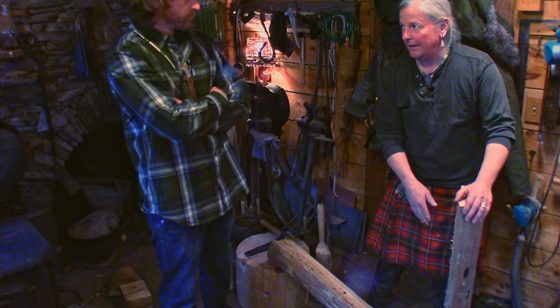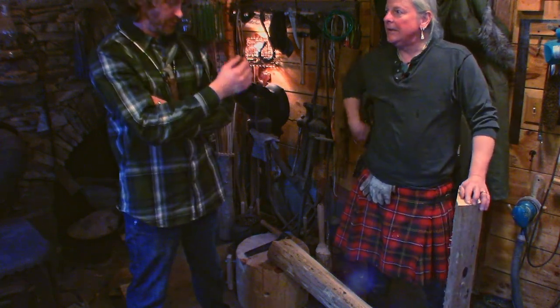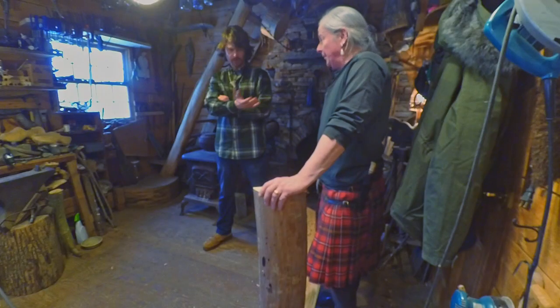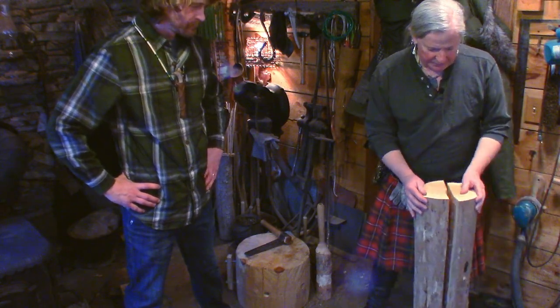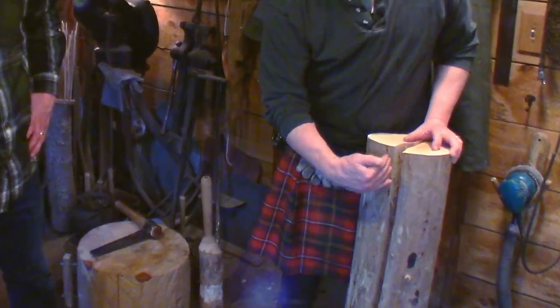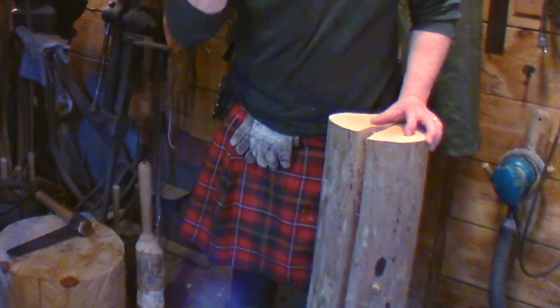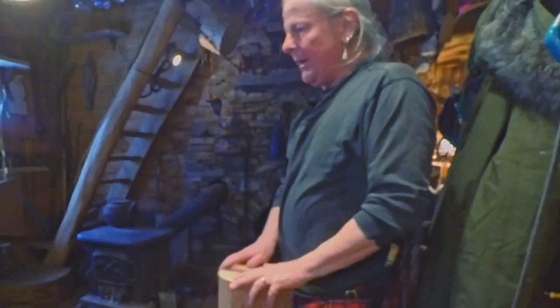Even if this hadn't already had a crack in it, it would have been probably even straighter because that crack does have to do with the structure of the wood. You can actually see a lot from this piece of wood. When I looked at this crack I could tell that the grain was straight, because the natural crack that appeared was straight, so I knew the whole tree would be like that.